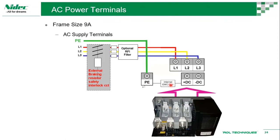So in some cases, we cannot do anything with the ELCB. We cannot upsize them. It's not adjustable, and the line is already too noisy. There are instances where we advise them to remove this EMC filter. For this case, you just remove the EMC filter's screw. So you don't really need to remove covers or whatsoever. Just remove a screw, then your EMC filter is isolated. It cuts off this connection and then your EMC filter is isolated.